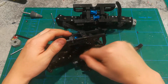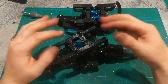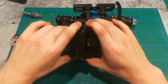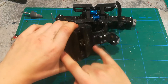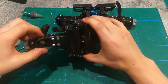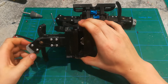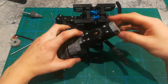This is to allow the front to be much stiffer in the suspension — otherwise the front would just sag down on the ground the whole time. The important thing to notice is that the axles are slightly offset. The centers of the axles are actually offset by 6 millimeters, which is exactly the scale as on the real model. On the real model it is 10 times that, so 6 centimeters. So that's pretty nice to be somewhat accurate.